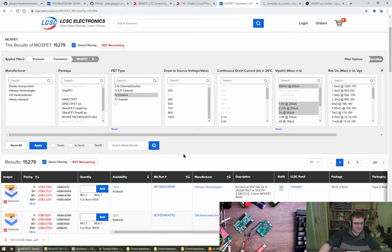Yes, charge controlled, and something that people often don't realise is that particularly on big FETs, it can actually take quite a bit of current to get that gate charged and discharged. So if your gate resistor is too big, you can actually have a significant period where it's in sort of the semiconductor state, whatever it's called. Linear region, thank you.